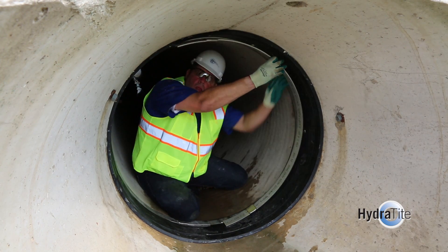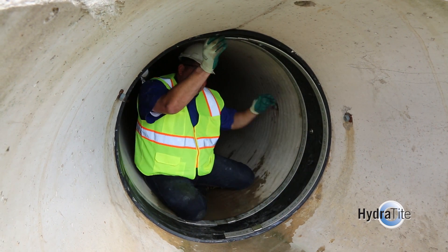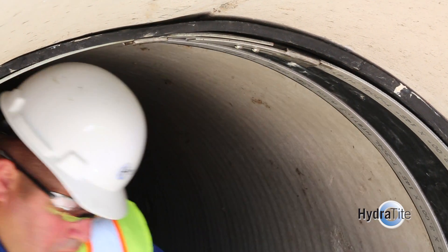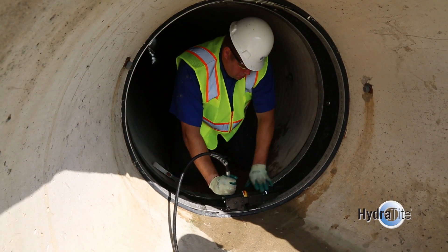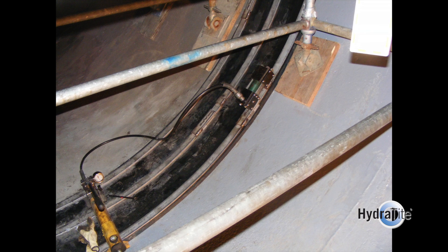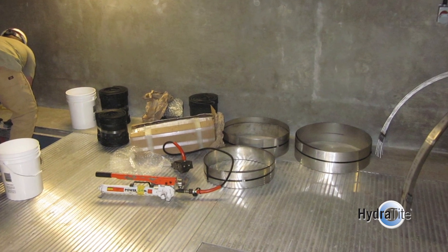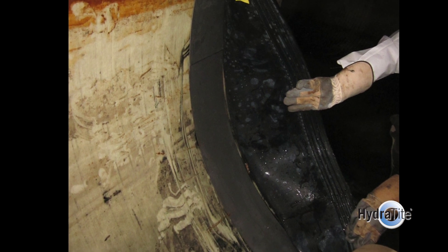Multi-piece bands are utilized in larger seals and for seals that have pipe access limitations. Unlike a one-piece band, multi-piece bands consist of ears that are slotted and fastened with two bolts, providing more expansion points and flexibility in the expansion process. This process can be used to stretch the rubber where two pipes have a different diameter, such as concrete to steel joints and cured-in-place liner-end seals. Additional bands can be used to provide reinforcement in the center due to head pressure. Backing plates can be utilized in pressure pipe situations to provide structural backing without the seal backing being extruded through a void.